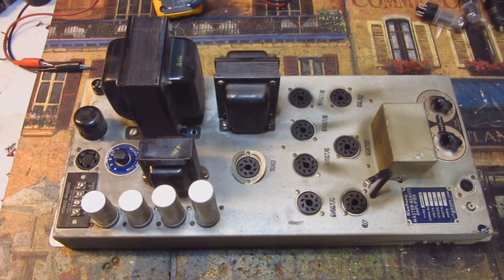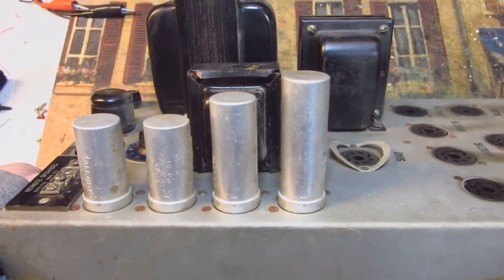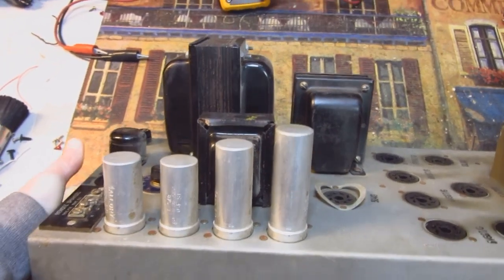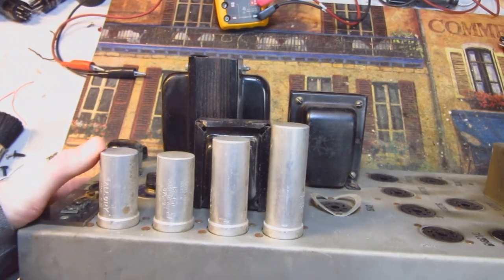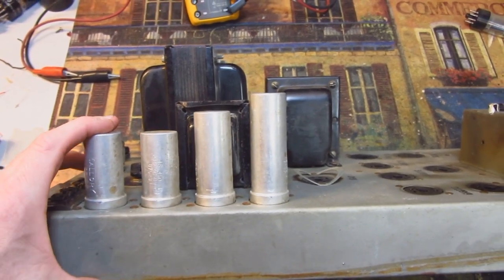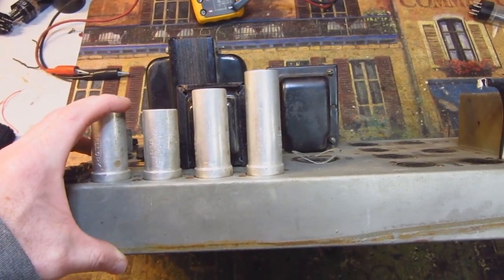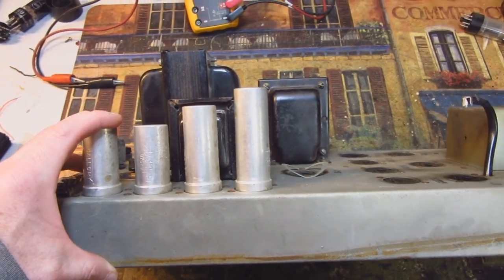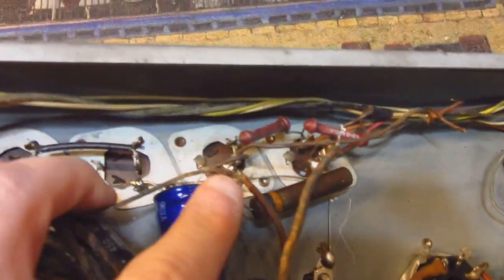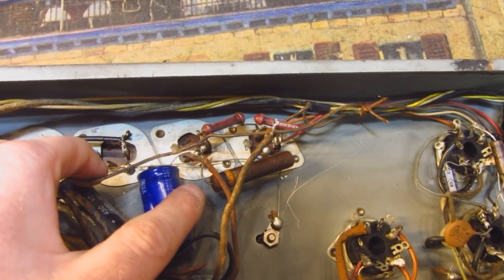I had a good idea pretty quickly what's wrong with this amp, but I'll show you a few things that are interesting. Two of these original filter caps are still in the circuit, and they're 70 years old, and they are perfect. When I did a quick check of the ESR of the two that were removed, I'm convinced they were actually replaced for preventative maintenance, because honestly these caps are fine too. All four of these electrolytics are in excellent shape. This amp plays fantastic — A-plus phenomenal. These caps have been operating continuously for 70 years.